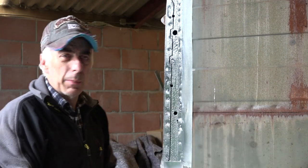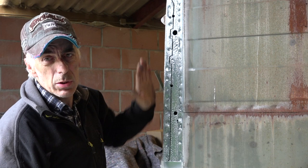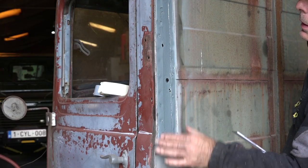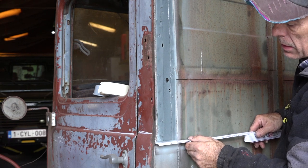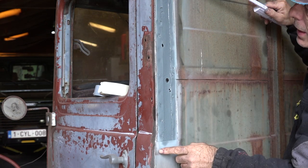I'm going to let it dry a little bit, and then we're going to create the panel that goes on the side here — we'll spray the inside of the panel with zinc spray as well. Now I'm going to prepare the panel and measure the maximum width. This is about 90 millimeters. I'm measuring along the side and I'm going to go for the widest measurement.